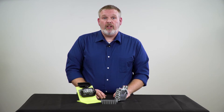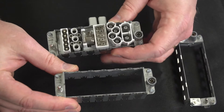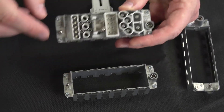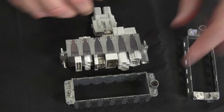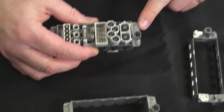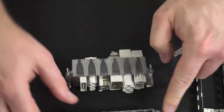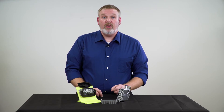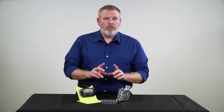This isn't the only feature needed to ensure consistent alignment. While having inserts installed in the correct orientation is important, you also want to be certain that each insert is in the proper slot for mating. Every modular frame includes letter coding for the slots A through F. Frames intended for the plug side or sleeve housings are coded with uppercase letters, while the mating side, often on a panel, uses lowercase letters. Frames with lowercase letters could also be mounted in a surface-mounted base or coupling housing. Slot identification is important because the modular frames are not symmetrical — they themselves are polarized by the integration of guide pins and sockets used to channel the PE lines.